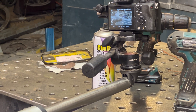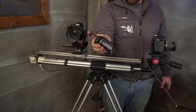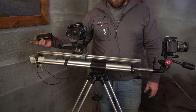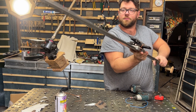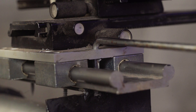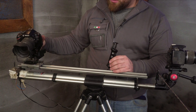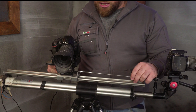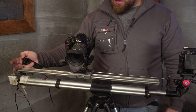I connected something else on the top — you can clearly see that this slider is so different. We have in this case two cameras mounted on top so you can see how everything works. With this I can control the speed of the motor, and using the switch on the back I can control the direction. I welded an arm and a bracket on top of the piston and cut a section of this industrial rail. This is a factory rail to move components and it's a very cheap solution — no vibration and moves so smoothly. I welded a stainless steel arm that fits perfectly inside the little hole I drilled inside the rail, so the piston extending or retracting will move the second camera without problems.